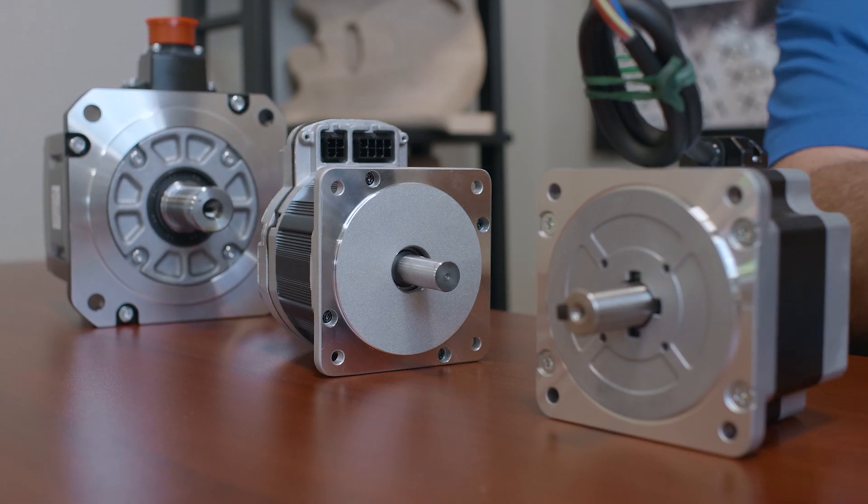For larger footprint machines, in most cases that typically utilize rack and pinion drive systems, we combine the Teknic ClearPath brushless servo motors with planetary drives. These actually have the motors and drives combined to create a very compact design solution while bringing closed loop feedback technology to the process. That would be for plasma and less demanding routing — a great application for those types of machining requirements.